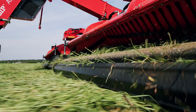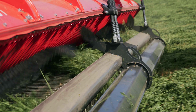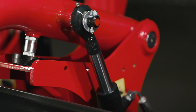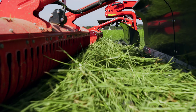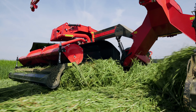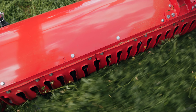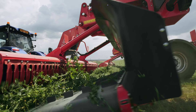The system also consists of a swath roller that prevents the forage slipping from the pickup unit, plus the finger rotor that accelerates the forage flow to the conveyor belt. The finger roller is additionally hydraulically suspended, thus adapting to the quantity of the forage. This well thought-out combination allows an uninterrupted forage flow without turbulence and thus prevents the loss of delicate leaves, which is of great importance when raking alfalfa or clover, thereby increasing the yield of crude protein per hectare of arable land.